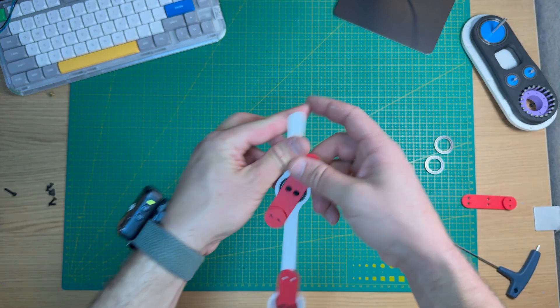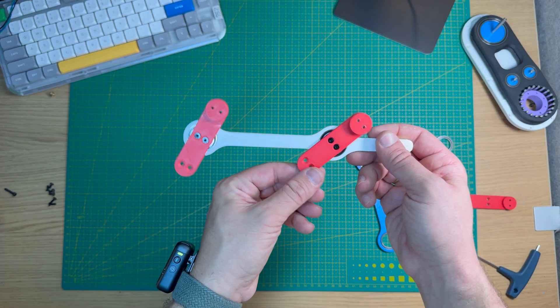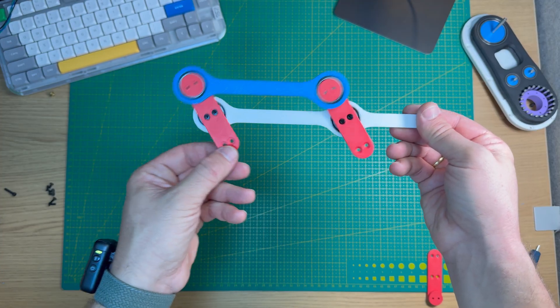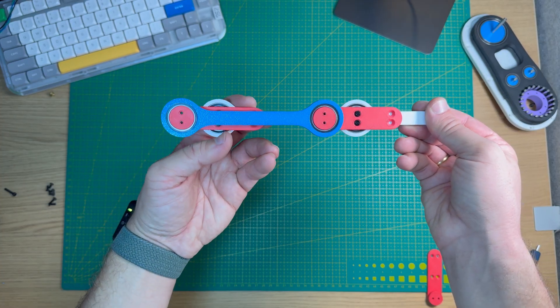As you can see, we have these independent red side links that represent our eccentric shafts — one driving and one driven — and a blue rod that moves parallel to the base. But when the rod becomes aligned with the base, the driven link no longer knows which way it should rotate, and it can flip the wrong way, breaking the parallel motion linkage.